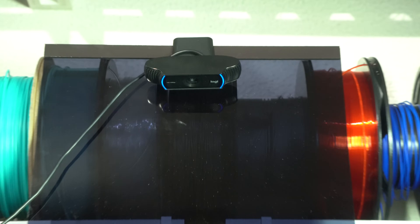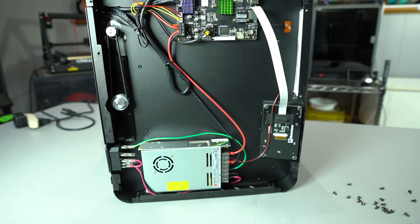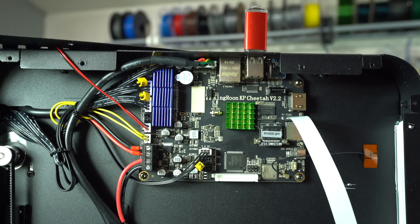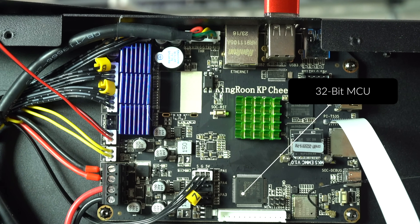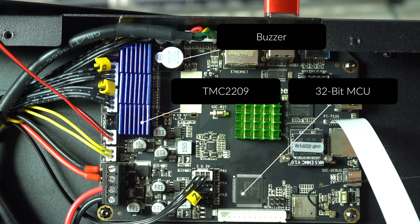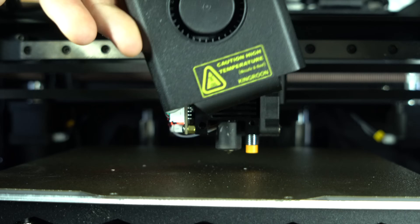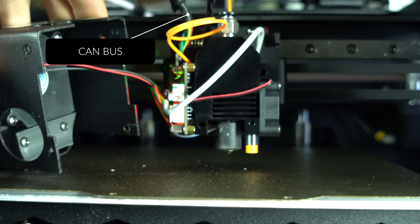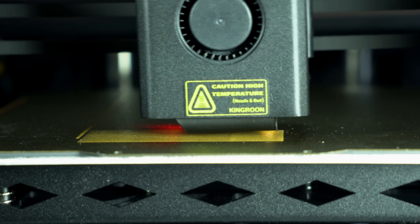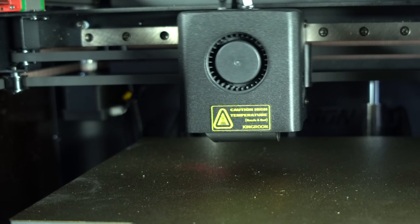There's no onboard camera, but we can easily connect a USB webcam for remote monitoring. Under the hood, we have a 300W 24V power supply. The brains of the operation is a custom control board, the Kingroon KP Cheetah version 2.2. It has a 32-bit MCU with TMC2209 silent stepper drivers, a buzzer for playing chimes, and a handful of unused ports for expansion. A downstream daughterboard on the toolhead is connected to the mainboard via CAN bus. This board has an RP2040 MCU — the same chip found on a Raspberry Pi Pico — which handles the Klipper computations. Additionally, we have an onboard ADXL345 accelerometer for input shaping.